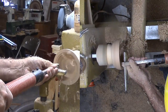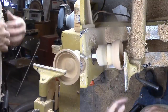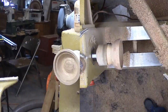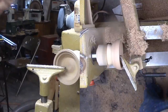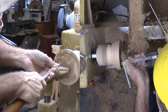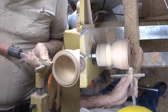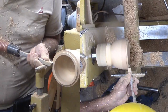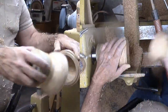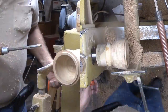This completes the rough turning. Now I need to fit the lid to the base. It's nearly always easier to start with a mortise. I've switched back to a square carbide cutter. I need to make sure the sides are parallel — sighting with a pen tube against the lathe bed is good enough for me. Back to the base to form the tenon. In my plan, I allowed an extra ring for the tenon. I'll waste nearly the entire ring so that I don't have a narrow ring at the joint. The extra length gives me plenty of length to test the fit from the mortise.